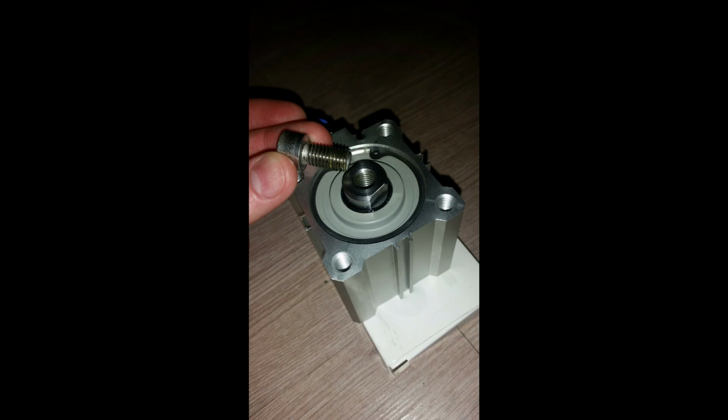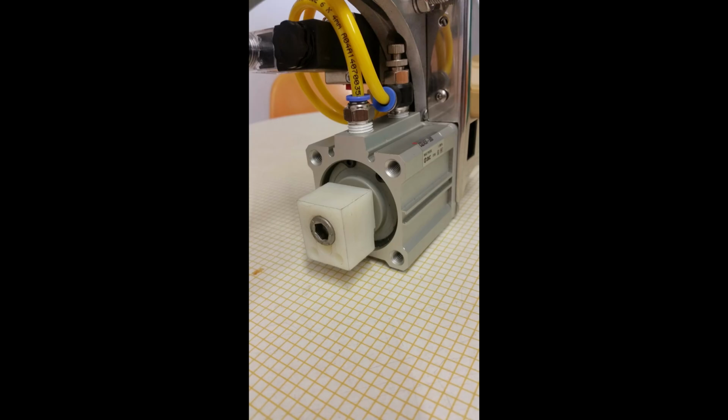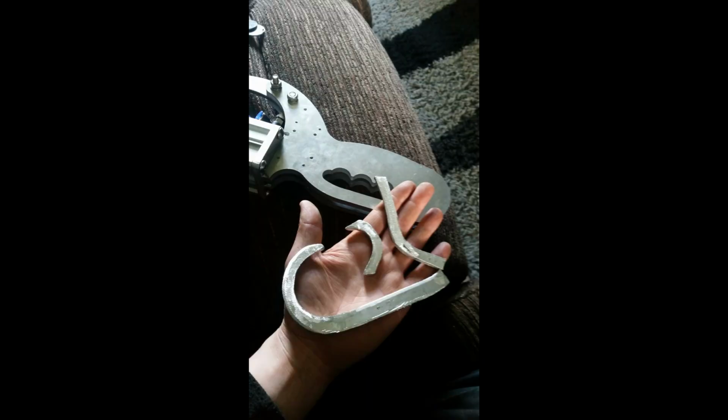This is the piston and the bolt that the nylon block will be placed onto. This is all the wee pieces again that were used for the enclosure and the clamp. This is the block screwed onto the piston for the first time, the nylon block. So this block is subjected to the force from the piston when the electrodes shut. Next photo is the washers where it goes right down the clamp to keep the clamp from pulling on when you're welding the two bits of plate together.